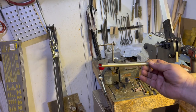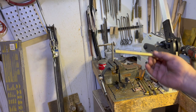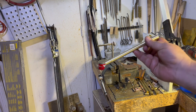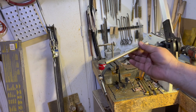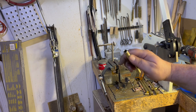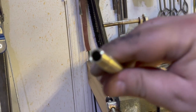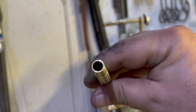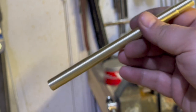I'm going to do some smoothing and some measuring and see what happens. There it is — the yellow brass lead pipe made on the H mandrel. It's a shorty, but that's what I want for this particular application. It's got a 349 Venturi, nice thick wall. I put it on the lathe and machined the end so I get nice crisp edges. We'll see you soon. Bye.